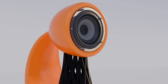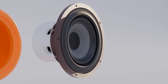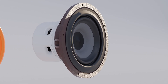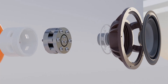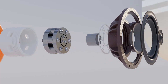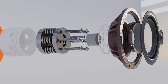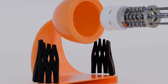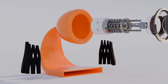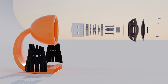In front of us is number 20, a 3.5-inch driver in a horn-based enclosure. This is a complete redesign using all new parts. It still screws together, as the last generations have. This generation uses the flat spring design spider and a short underhung voice coil. The motor is a brand new design utilizing neo-magnets in an array and laser-cut plate steel. The enclosure is a capsule-shaped pod that feeds the horn, which also doubles as the stand. The supports are carbon fiber PETG.